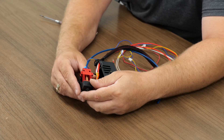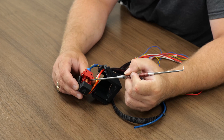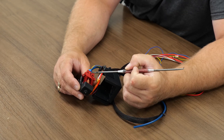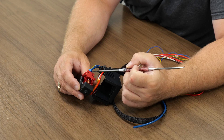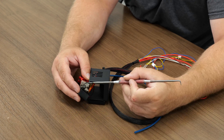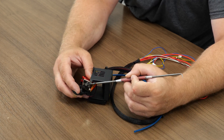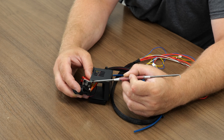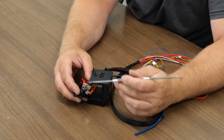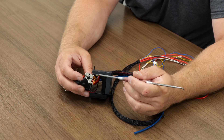One of the key differences here is this is an all-metal, bi-metal heat break. The tube stops somewhere around the middle, so it's not actually traveling through and touching your nozzle. They've used a hardened steel nozzle — it almost looks like a clone of a Micro Swiss. Normally you'd use a 6mm wrench on the standard one; on the high temperature one you'd use a 7mm wrench to remove the nozzle.